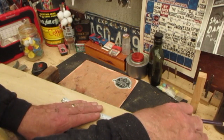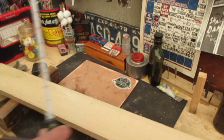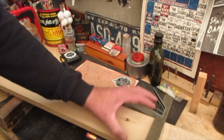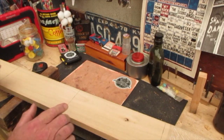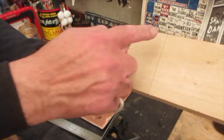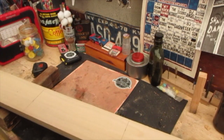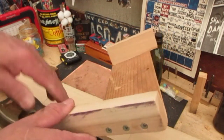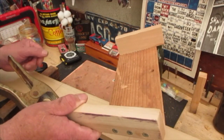I'm going to lay out ten-inch spots down the board until I have four marked sections. Then I'll take these to the chop saw, cut those four sections off, get rid of the split at the end, and then put on the scarf joint jig and cut them. I'll show you how quick it is to blow out four neck blanks with the scarf joint cut.